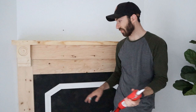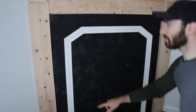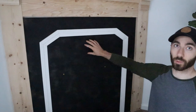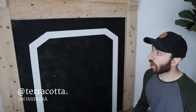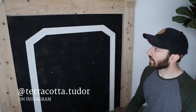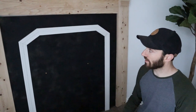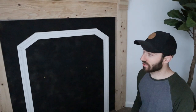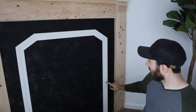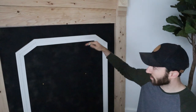Last night I finished installing the trim, so we have completed the fireplace as far as construction goes. We framed out inside of the fireplace where we are going to have the wood slices. Skye found an angled design on Instagram from one of our friends, so we went ahead and did that instead of a standard 90 degree angle. I'll be honest, I struggled a little bit with the angles at first. Essentially these two angles need to match to meet 90 degrees so it can go back to horizontal and be level.